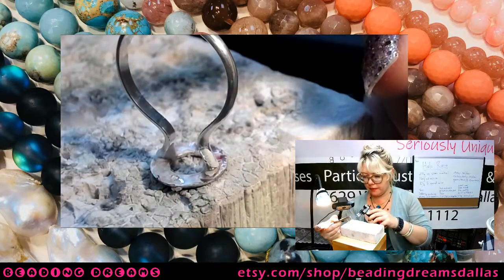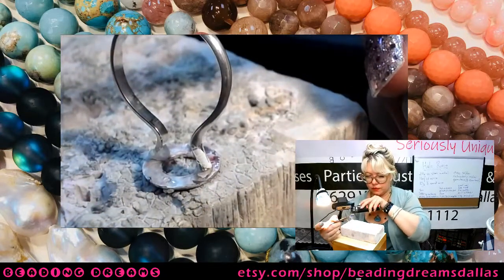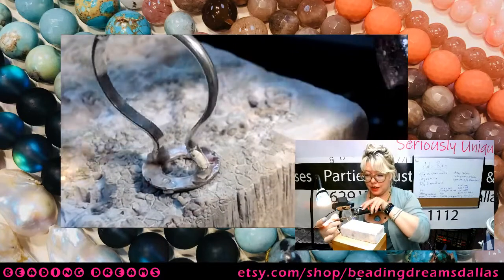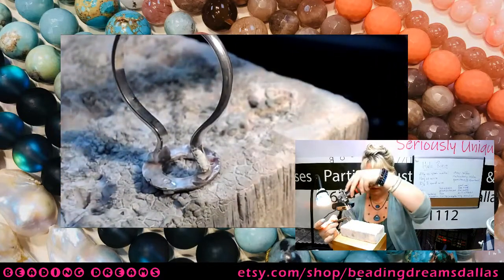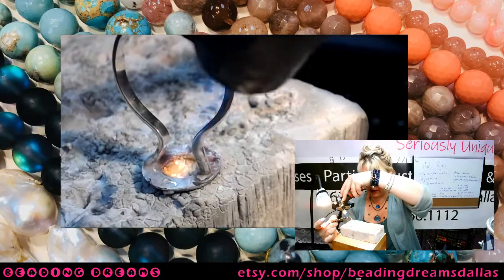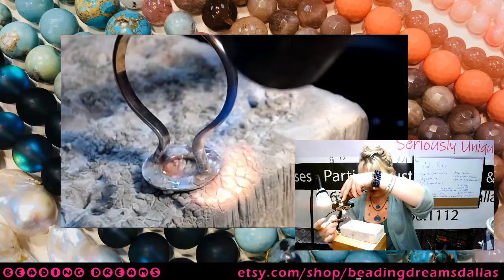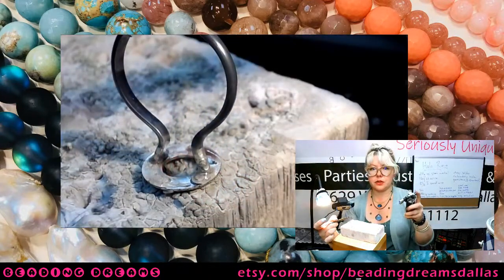Light your torch again. Watch your hand. Watch your hand and your camera. And you're gonna heat. That's a better angle. And I'm gonna heat until those two pieces of solder reflow and join everything together. So I've got my left hand one is good. Just waiting for my right hand one to go. Awesome. Take your torch away.